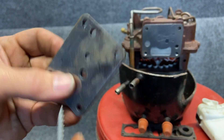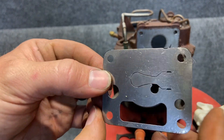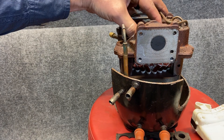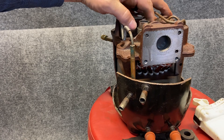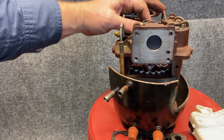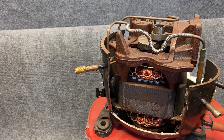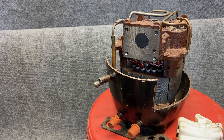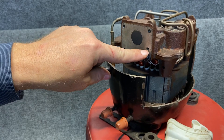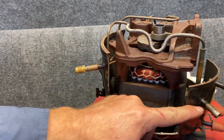It's a very small compressor so there's not much room there. Our other valve plate is here, and this valve will be facing the opposite direction. Here's our other valve plate — a reed valve — and you can see that valve just opens and closes. This is our piston, so as we turn our rotor you can see the reciprocating action happen. Once we discharge, it actually sends it through this head piece here. There's a little bitty tube right here that enters into this chamber, then all the way down, around and back out the discharge line right here. The suction is just on the casing.